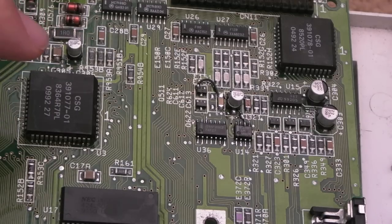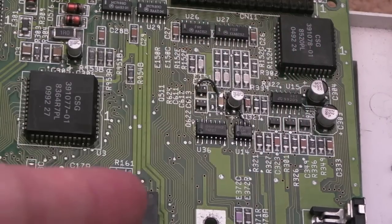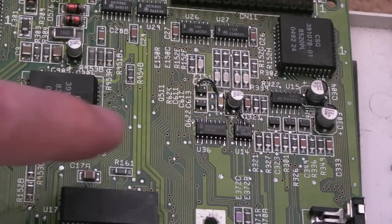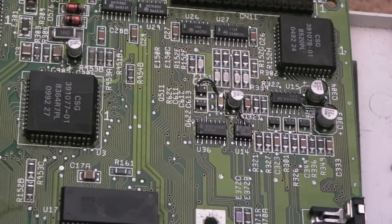On this system, it's able to start booting. Some of the things have had enough of a pause from the initial power on to go, all right, let's get going. But they've not all been reset cleanly at the same time, with a specific delay and then released, like a start gun to start the race, so that everything starts at the same time. That's why we were getting really weird behavior with the keyboard. And the keyboard was influencing the KB reset signal as well, which just confused matters. But I am confident that that is now 100%.